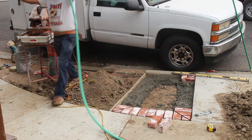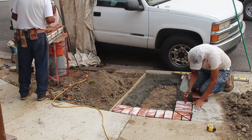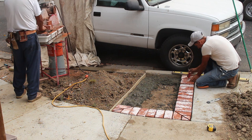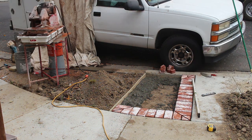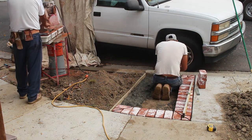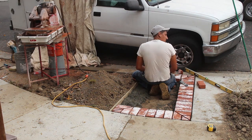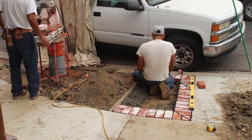On these corner cuts, it's actually the same two bricks on the corner. What you do is lay them out in a line, then draw a pencil line from corner to corner of four bricks. You cut it and then flip the bricks over — so these are actually the same brick. There's really no wasted brick when you do the corner cuts this way. I might have a close-up view or more detail on one of these cuts as we go through this video.